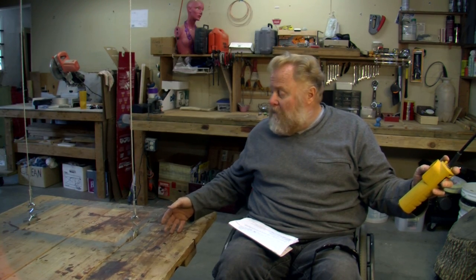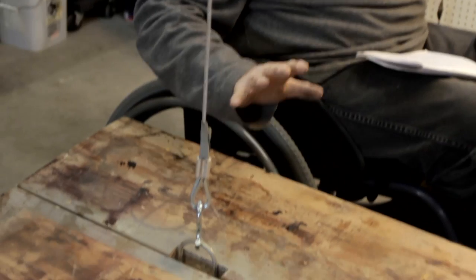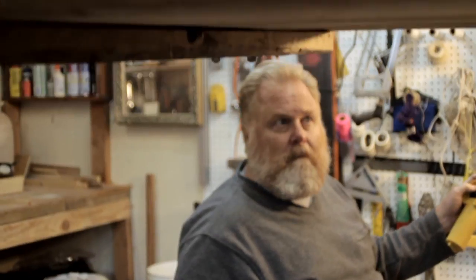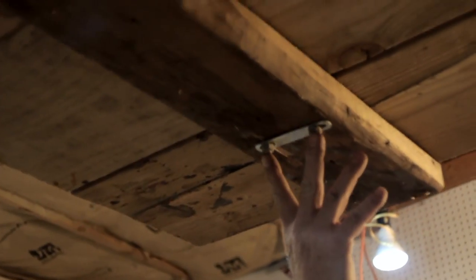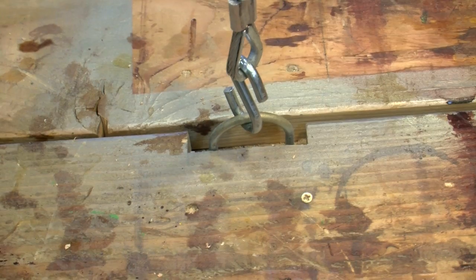To begin with, let's look at the bench structure itself. There's U-bolts and the 2x12s that actually make up the bench. The U-bolts are drilled through the 2x12s and 2x6s below in order to hold the bench and make the structure. You can see that beneath, the U-bolts go through and are bolted with a strap and nuts that make up the lifting portion of the bench.